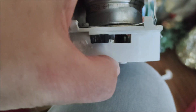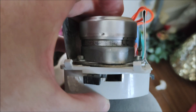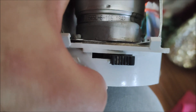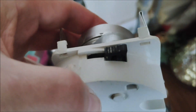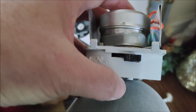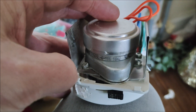If you get a problem and your synchronous motor valve fails, you can override it by pushing this lever up and then down into that position — that's your emergency override, which holds it open. So if you can't get your heating on, put that lever up there, lock it into place, and it should open this valve and then everything else should start to function. But now I need to put the cover back on and then put the motor head back onto the valve.